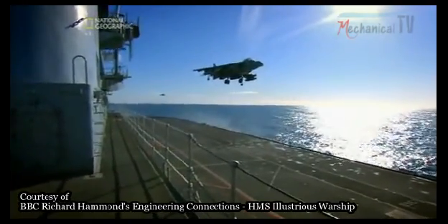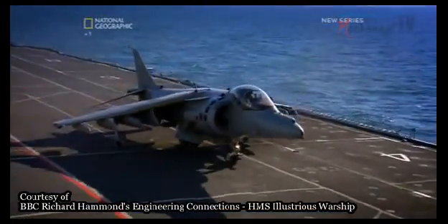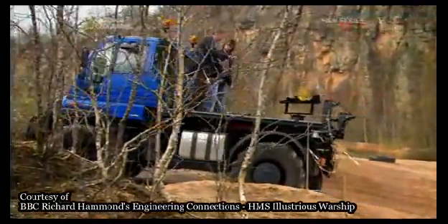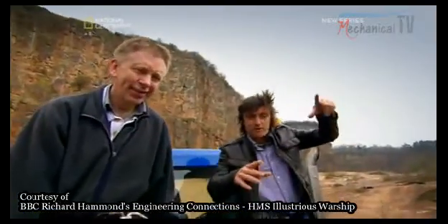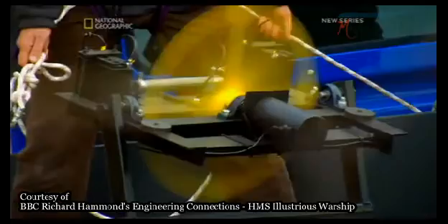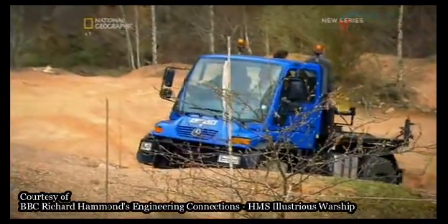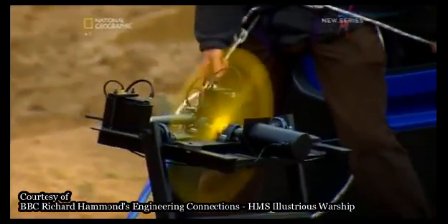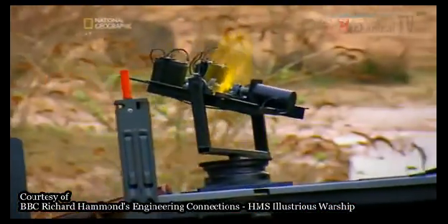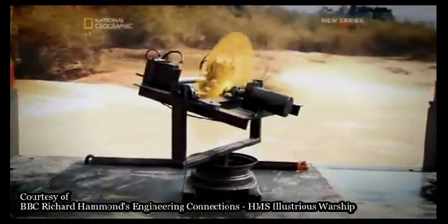And it's this behaviour that allows the aircraft carrier to keep its flight deck level. To show how it works, I've built my own gyroscope — a spinning disc free to rotate in any direction. It is important to remember that it's not moving; we are. Just like the spinning top, it stays spinning in the same axis, but the truck moves underneath it. There it goes — it's turning around. At least to us it's turning around, but it's not: it's the truck that's turning. We're able to detect our motion relative to that. It wants to stay exactly where it is, in space, and we are now moving around it. By measuring the difference in movement between the gyroscope and the truck — or ship — we can compensate for that movement.